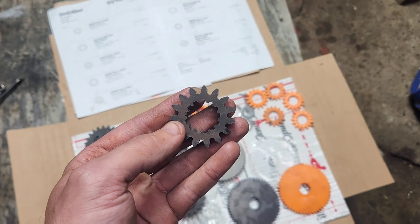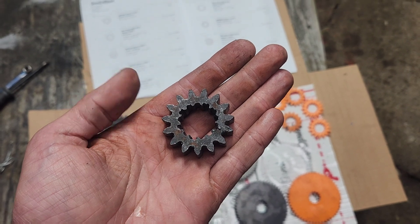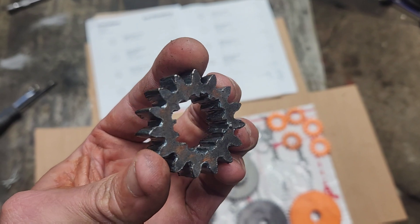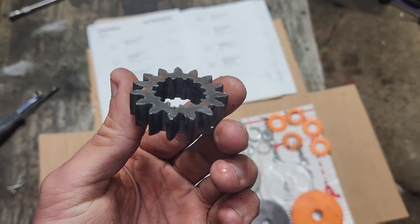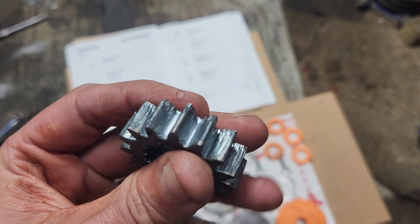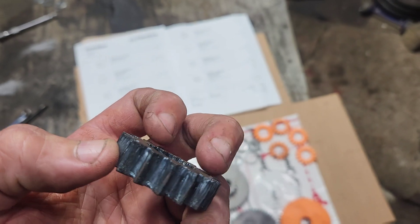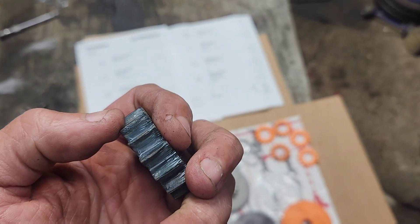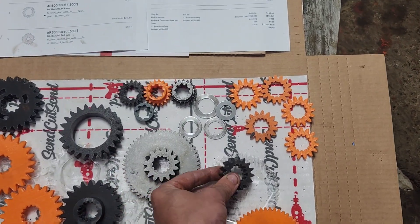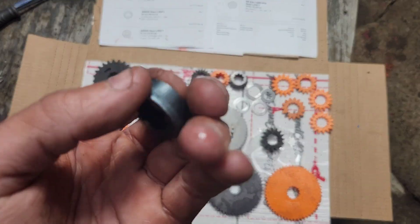Here's the problem. That one looks beautiful, but that one does not. The laser cutting is not perfect past about a quarter inch thick, from what I can understand from everybody I've spoken to. You can actually see it on this piece — see how nice and pretty, and then it gets all wavy. It just goes past about a quarter of an inch on this AR500. This one here is cut out of mild steel, done as a spacer prototype.